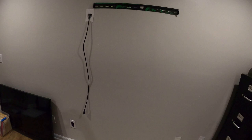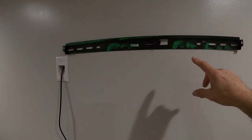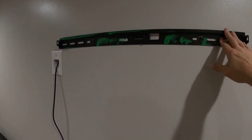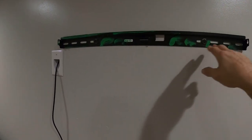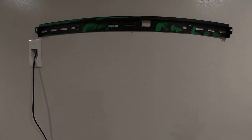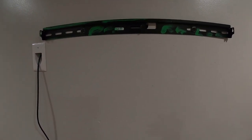The next thing I want to do is turn my TV back up there. If you've got two people, both of you can lift it up and plug it in at the same time. I'm by myself, so I'll have to lift it up, fold it forward, and plug it in. One other thing with the mount - I've got a single bar mount here. Most mounts have two bars. If you can find these single bar mounts, Sanus makes one and there are a couple other brands. Even the Amazon one with all the nail holes still has bolt holes. I would never recommend hanging a TV on 42 nails - try to find a stud for every bolt.